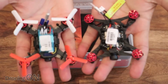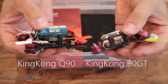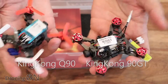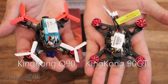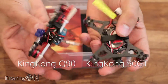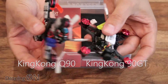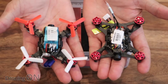To put the two side by side you can see how radical the differences are. No longer do we have this very tall high-stacked flight controller and speed controller array. We've got a neat four-in-one board on this and we don't have individual speed controllers on the arms. We've got a completely different type of frame here which feels really solid compared to the rather flimsy frame of the Q90, and overall this is just a lighter quadcopter — so although it's an evolution in the model, it's a completely different beast.